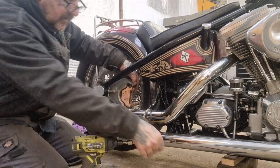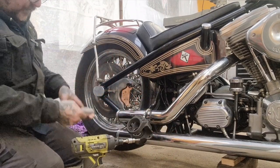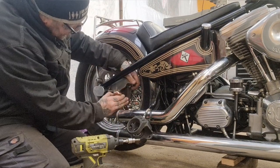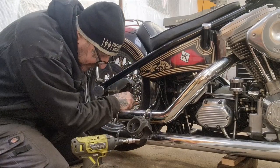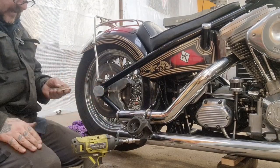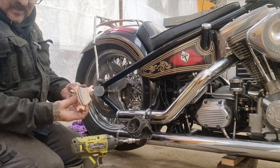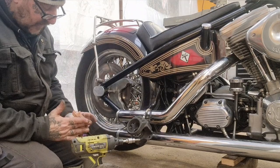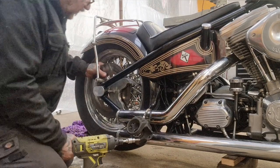And also stainless steel sliders - there's a little bit you can see where they've just scuffed slightly where they've been touching. But it's far from even and that's where he's losing his braking. I totally believe it's just because this disc is warped. So let's have a look. There are wheel adjusters each side here and what I'm going to do is just crack the lock nut and wind them out with a ratcheting spanner.